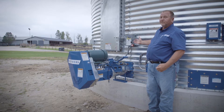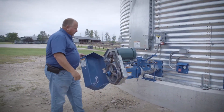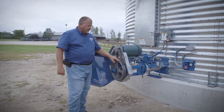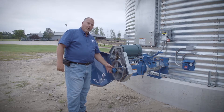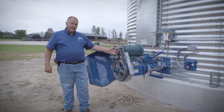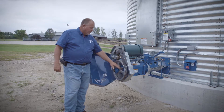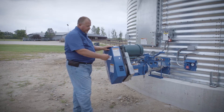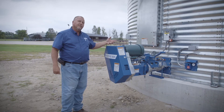On the service side, we want to look at the jaw clutch and the belts and pulleys on the drive unit. Make sure the belts are all in good shape, the pulleys are in good shape with no excessive wear. The jaw clutch should move freely in and out with no wearing on the jaws. The belt tightener should be lined up, tight, with no excessive wear or play in the pulley or bearings. We want to make sure the belt guard is in good shape, and whenever we're done servicing, we put the belt guard back in place so nobody can come in contact with the belts while the machine is running.